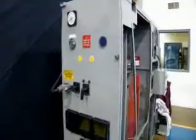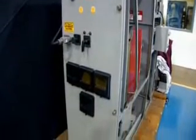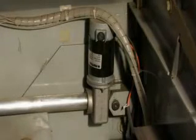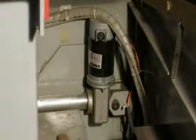First, we'll look at breakers with a lever-style racking system, for example, Allis-Chalmers Type MA breakers. In these applications, a motor actuator is installed in each breaker cell where remote racking is required. Other components, such as a breaker guide, limit switches, and control wiring are installed. The circuit breaker is then rolled into the cubicle compartment and is hooked to the remote racking system.